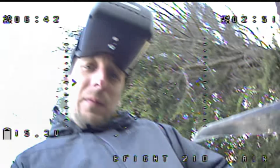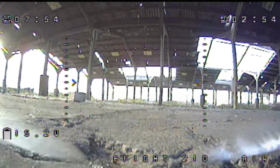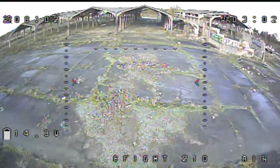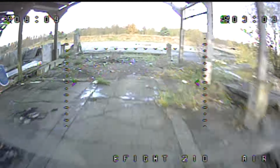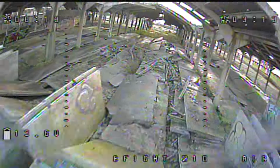All of this is mounted to a thick 4mm frame that has cutouts along the arms for efficiency. Now, there's no issues with this in plenty of crashes so far, although I can't actually see any spares for this available anywhere. Hopefully that will happen, because I think it's an excellent design, but I do think it needs a slight change in the camera mount too. The arms can be replaced just by removing two bolts, and the stack remains completely untouched. It's a super low profile design and light too, at 275 grams without the LiPo or props.